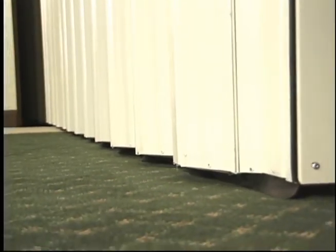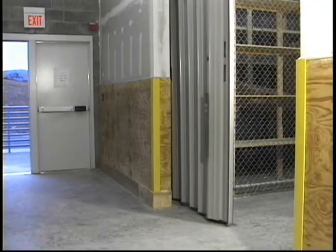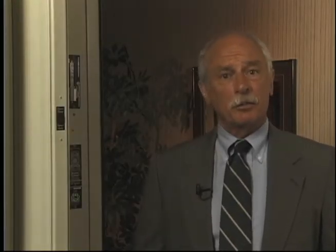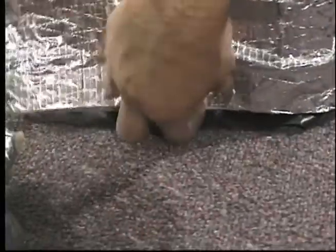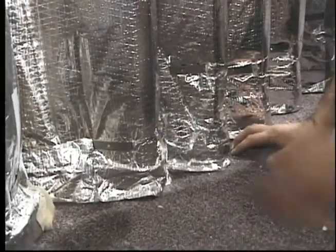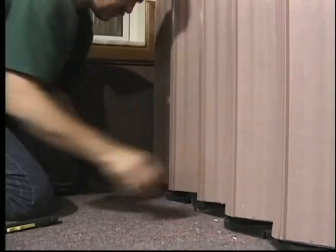You'll notice that when the accordion-type fire door is installed, there's never any need for a floor track. The fire and smoke seal is provided by the fire protective liner on the inside of the fire door. This outer trim piece assists in smoke control but is primarily used for decorative purposes. All fully completed installations should have the fire protective liner trimmed to maintain light friction contact with the floor surface. This can easily be checked by putting your hand under the outer trim piece and feeling the liner.